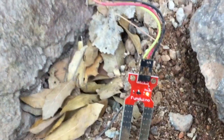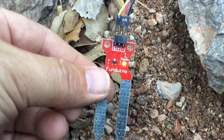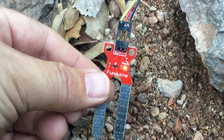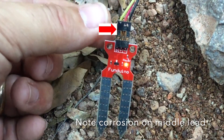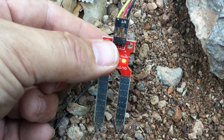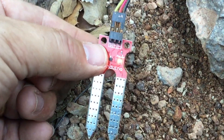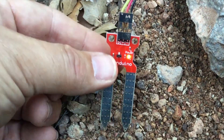Here's a new sensor we brought down. The nice thing about these little cheap sensors from China is they give you an indicator light showing that the sensor is getting power, so this will work. The problem is these little DuPont headers — these things are not going to hold up to the elements very well. I had to really twist this thing to get a closed circuit on that light, so I'm going to have to come up with something better for that.